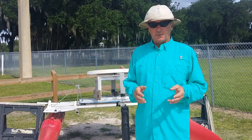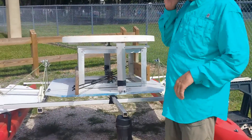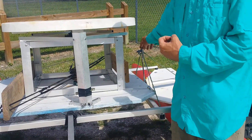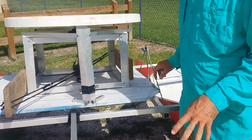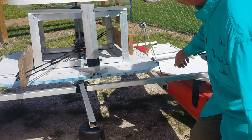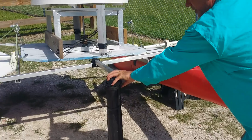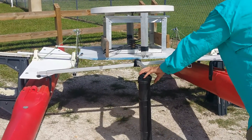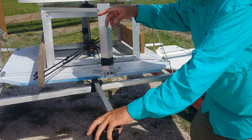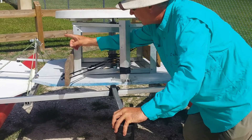But this is a proof-of-concept vessel. Come on in and let me show you a little bit about the mechanics of this. It works with a block and tackle. You'll notice on this side we have a tower — or we can call that a PTO, a power takeoff — this is where the power is coming from. This only works when you're quartering the seas, meaning when you're at a 45-degree angle from the waves. As this hull lifts, the other hull is going down in the trough and this one is coming up, and that pulls tension on this cable, which will then go to this cog. Conversely, the same thing happens at the same time on the other side. We have a power takeoff on each one.